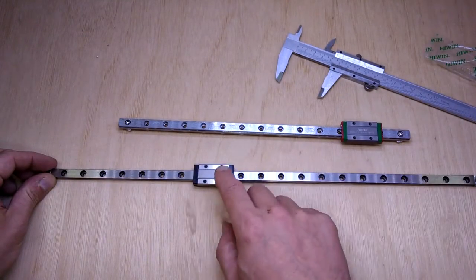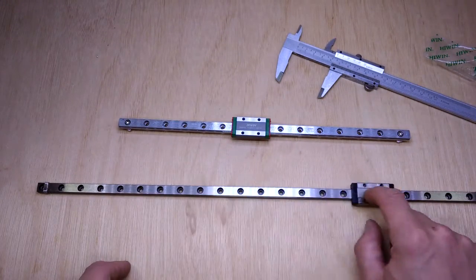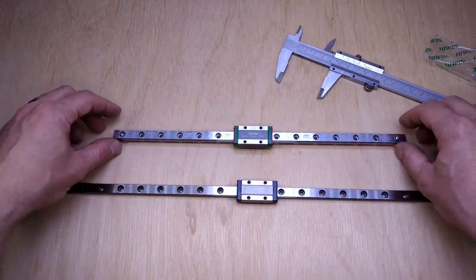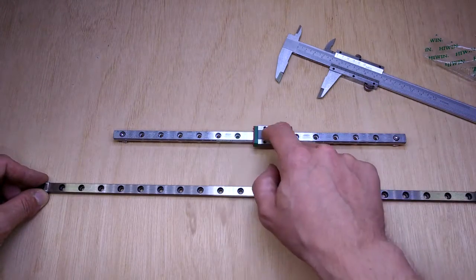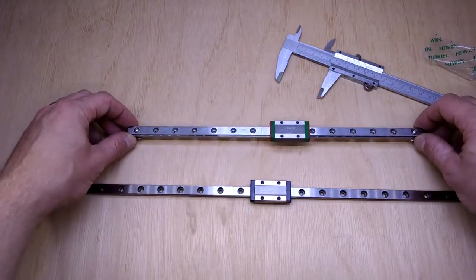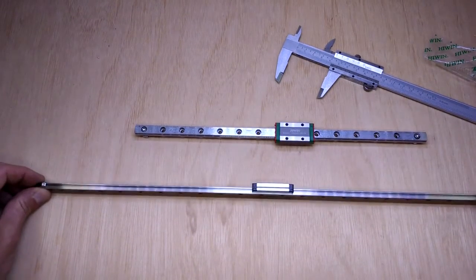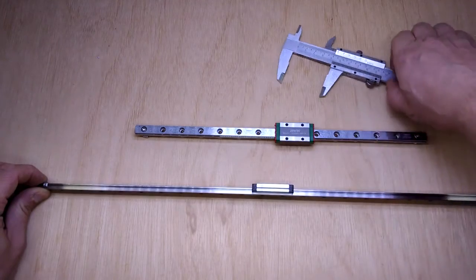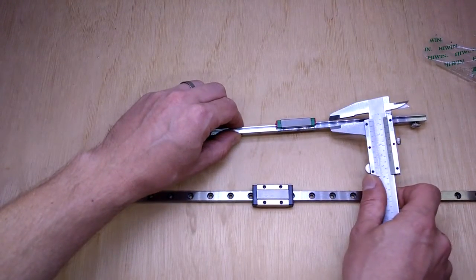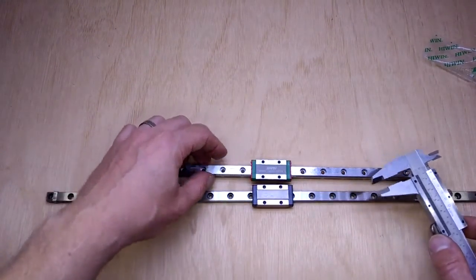None of this really tells us a huge amount about how well these are going to perform in a dynamic loading scenario, because what my fingers won't be able to tell is the kind of deflections these carriages and rails are going to show under changes of direction of the 3D printer. I've got a CoreXY in mind — this Highwind is destined to be the X gantry rail, and I'm going to have two Robot Dig rails for the Y axis. In terms of rail dimensions they're broadly comparable, although there is about a half millimeter increase in height on the Highwind.